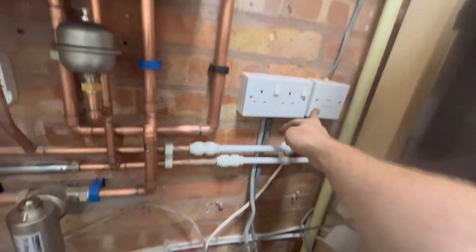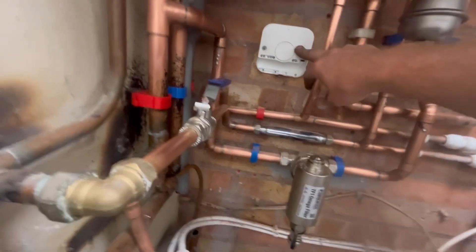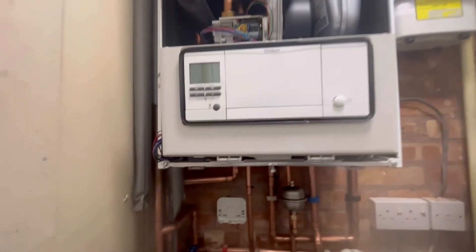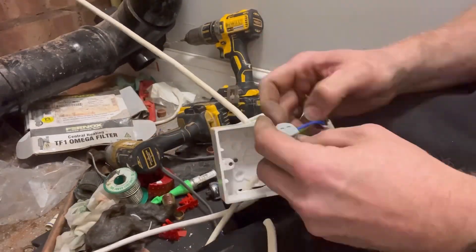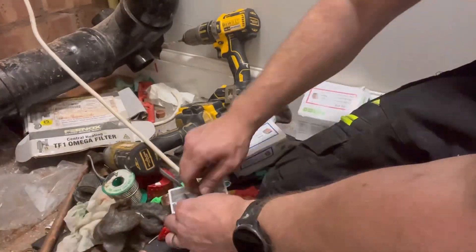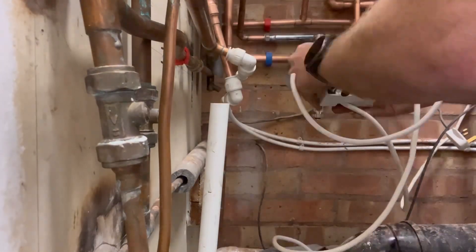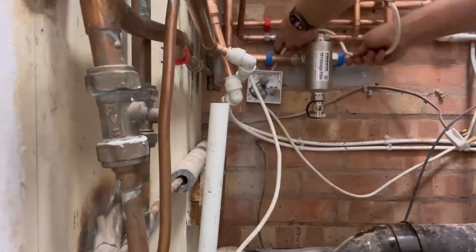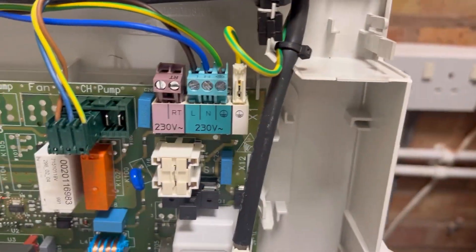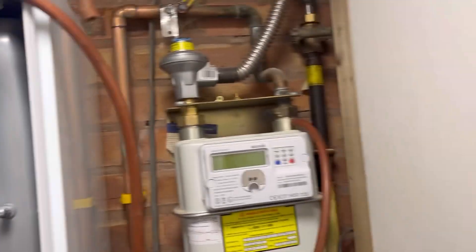For the electrics I've got a few spares — obviously I'm going to bring the cable around to the junction box, put that on the wall, then wire it up to the Nest. Once I've got it up to the Nest, wire it into the boiler — 24 volt connection for the switches, then live, neutral, earth, power. All connected, Nest on, we've got power. Just going to do a tightness test and pair it all up, see what happens.